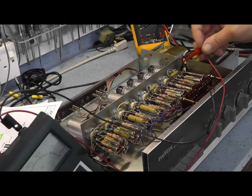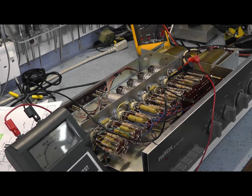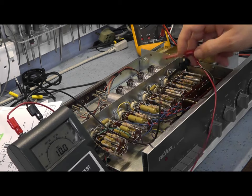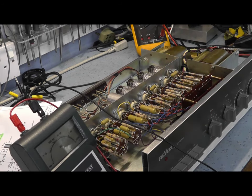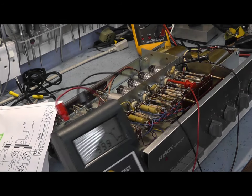Obviously, there's no semiconductors in this thing, so in theory, it shouldn't make any difference at all. We're measuring, because I expect the same volt. Yeah, say 10 meg. So that capacitor is possibly a little bit leaky, but I'm not too worried about it. But maybe we'll just disconnect it one end and check it again out of circuit.